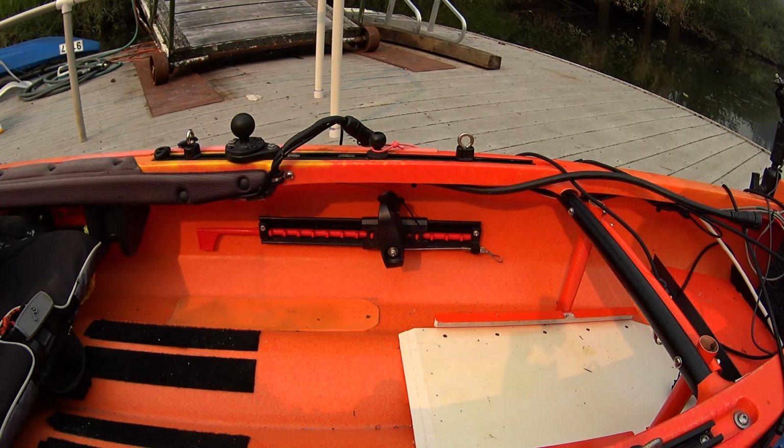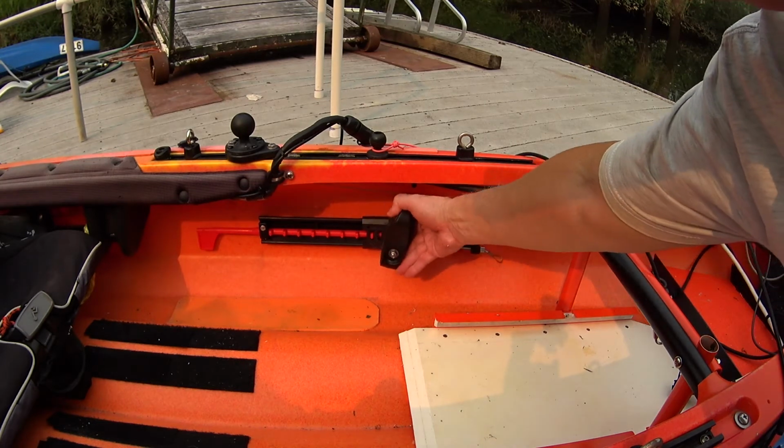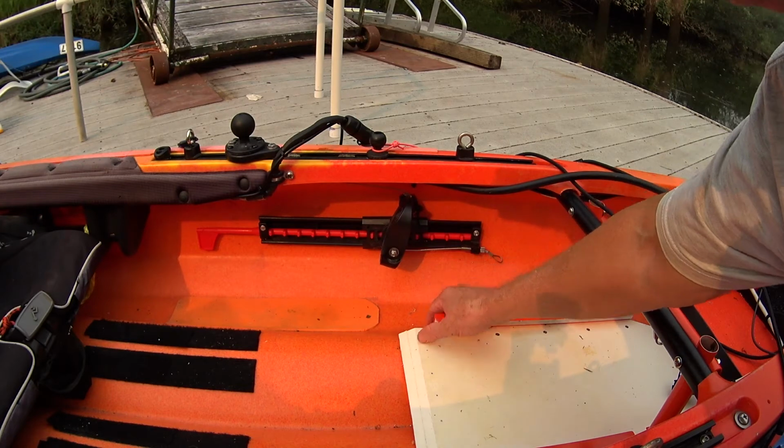I really like the way they work. Specifically, you can adjust the rudder pedals from your seat without having to do any contortions by lifting the red handle on the end, rotating it 90 degrees, and then sliding the pedal with your toe. And in a kayak with a cockpit, it's very easy to reach everything and do it quite accurately. I've gotten a lot of experience using these on my Skylark. The big difference for rudder control is they've added a toe steering or toe rotation design, where pressing on the toe allows the pedal to go back and forward and pulls in the cable for steering the rudder.